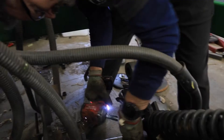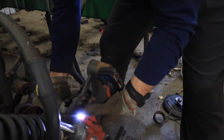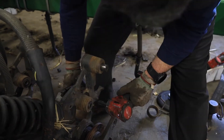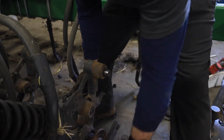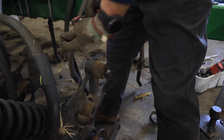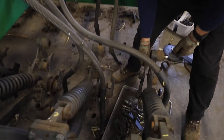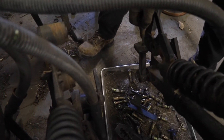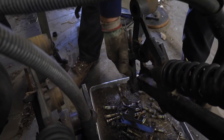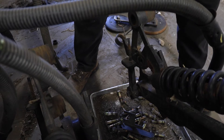I'm going to take the shifter plate off and also the depth handle with a half-inch socket — there are just two bolts back in here. It's actually a carriage bolt that holds it, so you don't have to hold the inside. We'll retain those because we are reusing them — just use a 9/16 socket to get that handle off. We will be putting in a new handle, new shifter plate, and a new arm. Here's a really great example of how much play we have in this arm, and once we replace this arm and shaft it'll take up that play and tighten up the whole assembly so the depth gauge wheel will have very little play at all.